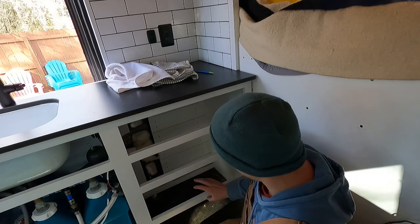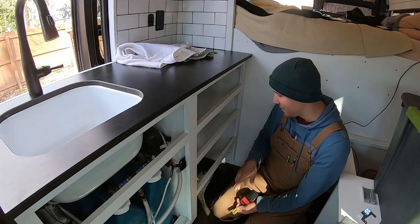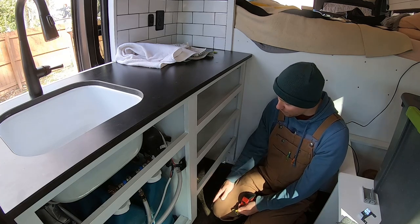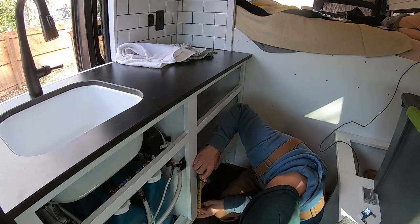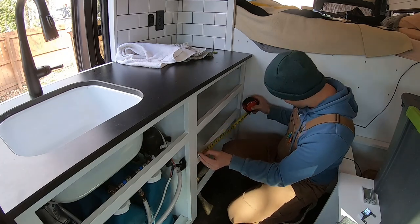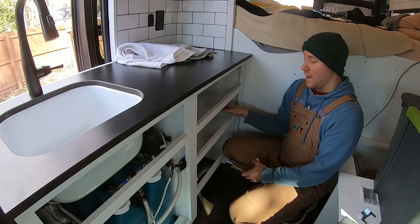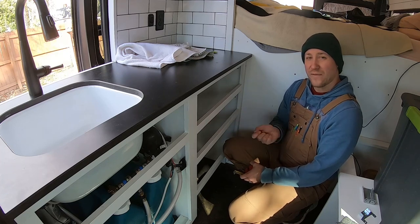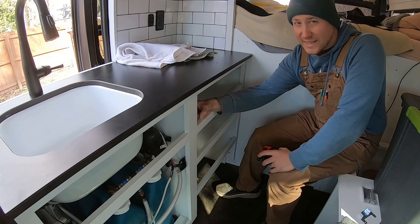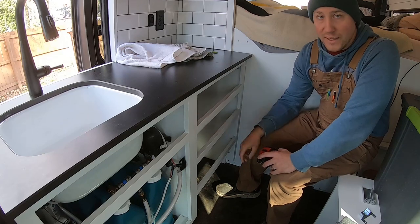These two drawers I made the same. This one is actually seven and a half inches. These ones were supposed to be five and a half but they're a little bit off. The bottom drawer we're gonna have to figure out as we go — at least that top part is exactly eight inches. Definitely double check that all your openings are the same. If it's not square, you have to make sure the rails are square and your boxes are square, otherwise you will have issues with your slides pulling in and out. I think it's a half inch with about a sixteenth-inch play, so you've got to make sure your boxes fit exactly or your drawer slides won't work.